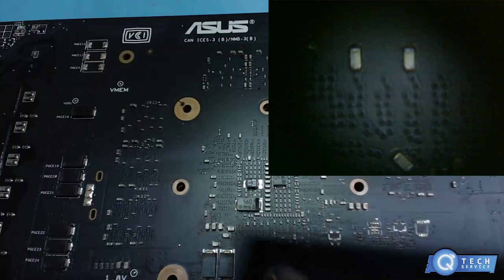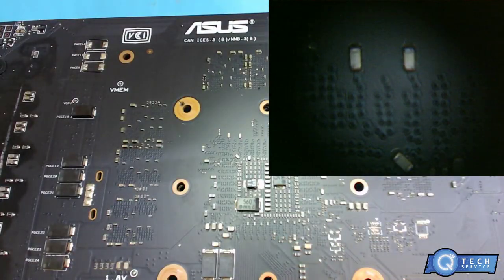Good days. The good old days, right? No, I'm just saying, because you modded this. Doing the X-clamp mod on the Red Ring of Death. Yeah. Great. Just a couple washers. I never liked re-thermal paste. It was a no-no for them. Yeah, they were easy, because I knew that wasn't the bottom line issue. You didn't need to reflow.